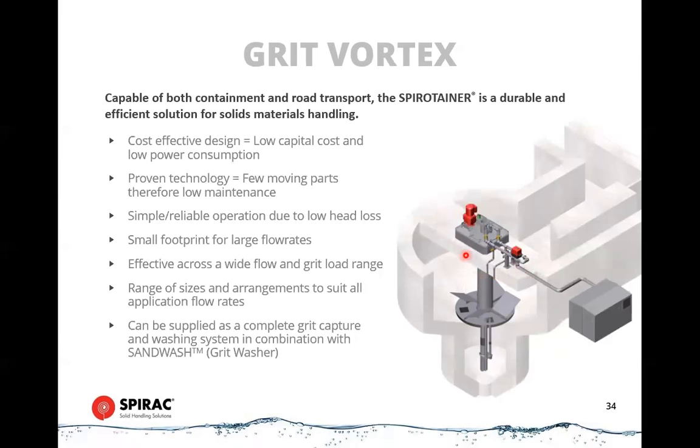So the advantage of stainless steel, obviously, is that you don't have all the civil works involved in pouring. There's a lot of concrete volume involved in this, and it's a permanent fixture. But if you put a stainless steel tank out there and the associated channel work with it, then that becomes a system that you can move later on, or you can expand it. There's all kinds of things that can be done with that later on that the concrete obviously won't allow for.